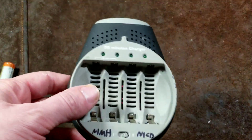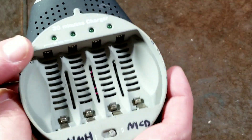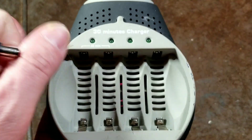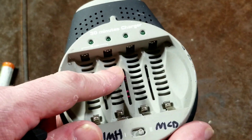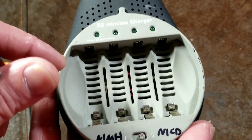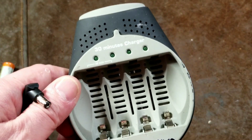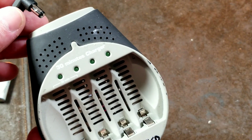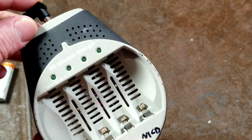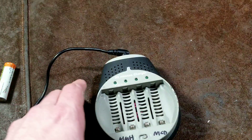It really is a pretty stout charger in the world of chargers. You'll want to make sure that you are not topping off a battery — that's the most likely scenario for a fire, because it can't sense when a battery is being topped off or is already charged and thrown back in the charger. It's when it's most likely to be unable to detect what is known as a negative delta and therefore overcharges the battery.